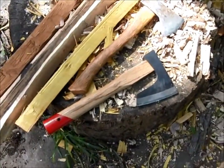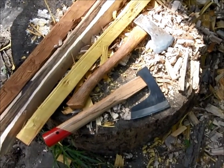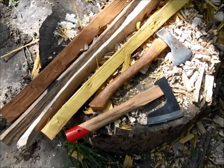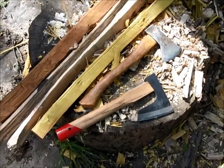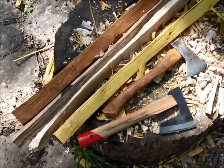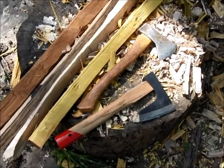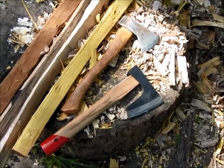These are two different hatchets that I've been using for primary reduction of wood pieces for woodworking with hand tools. It's a very effective technique when you're working with hand tools to start off with a hatchet or something to really work a piece down, because otherwise you're going to spend a lot of time carving. I just want to show you a little bit how to use these things and also what you're looking to get in a hatchet.